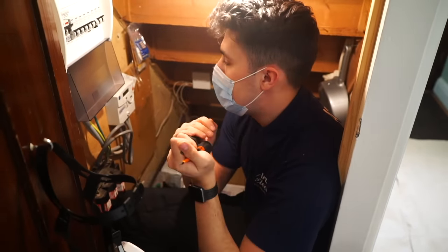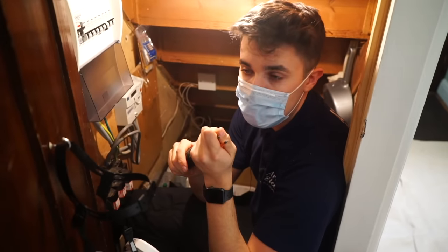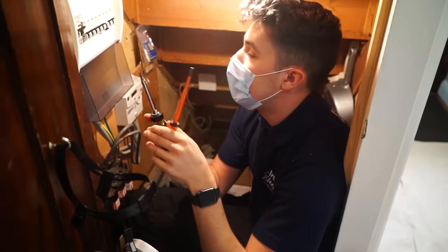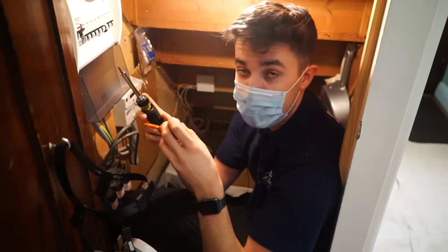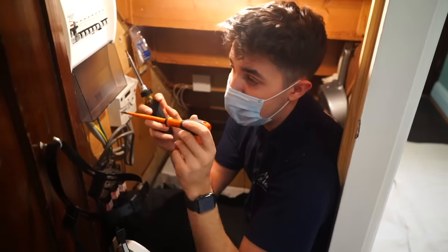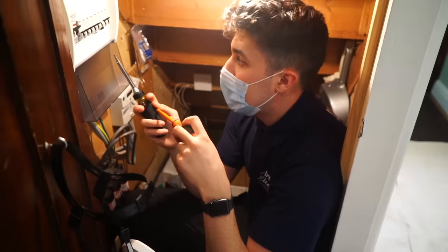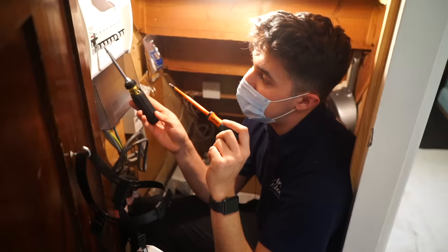So the plan is, we've fixed as many as we can as we've gone, and tomorrow I'm going to come back, I'm bringing a friend with me, and we're just going to try and blitz out as much as we can. All the rings that are broken, I don't think are broken because of bad connections. I think they're broken because of incompetent wiring. Because in the office next door, you've got all dado trunking and things, and yeah, you can tell it's just incompetence.